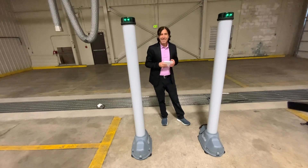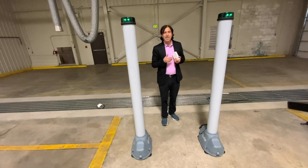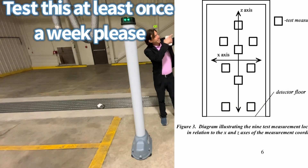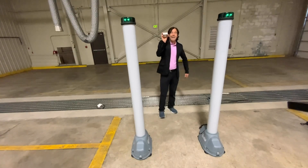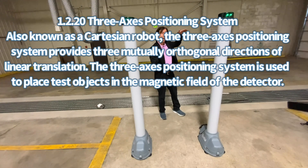When you test a metal detector you don't just walk through. You want to test at the positions specified in the National Institute of Justice standard. Looking at this document, it shows multiple test positions — you need to test at each of those locations. The document also tells you how to change the axis when you're actually testing it.